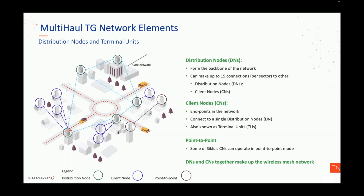Now, we're different than other folks that have existing systems that use what's called OpenR and Terragraph. We don't use OpenR. OpenR is a layer 3 platform, and the problem with OpenR is that to program a unit, or in a failover situation to change to another route, you have to have connectivity to your router. The advantage to ours is we're all layer 2, so the programming happens directly on the unit. That means you can be plugged directly into a radio, configure the radio, and work with the system without going to an outside controller.